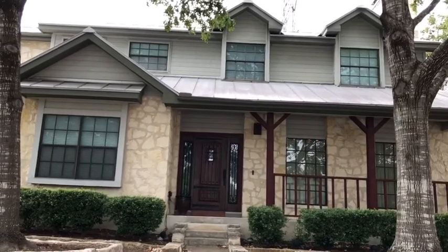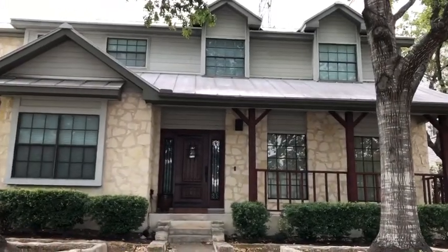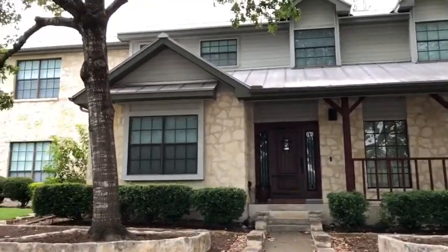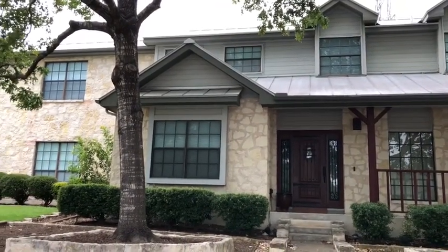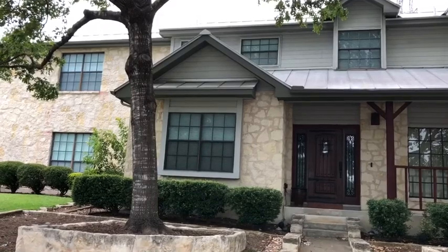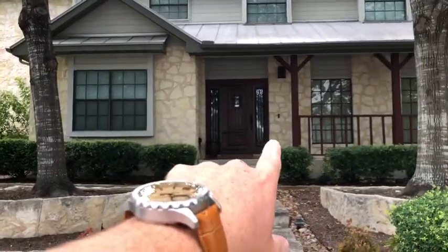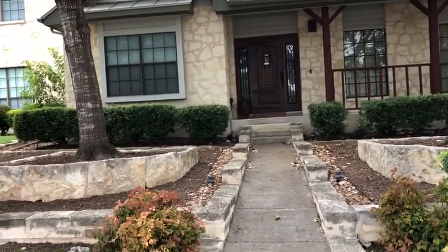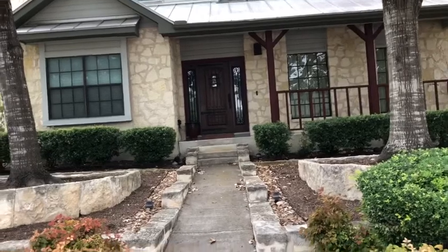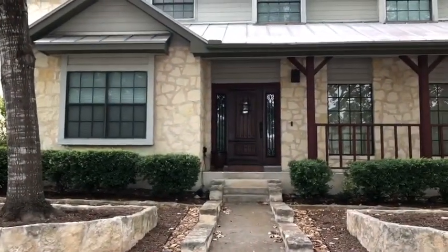All exterior trim, meaning window trim, you can see it's pretty rotted at the bottoms of both dormers. All exterior exposure trim will be replaced with Hardie 1x4. So as will the fascia, through the fascia overlay. But all the trim around the windows, even the front door trim, that 1x4 that surrounds the door, that's a new door they had put on, I guess, a little while back. That door and side lights will be wrapped with Hardie 1x4.